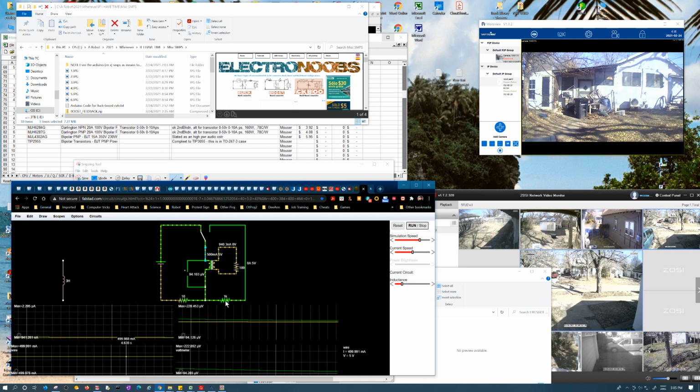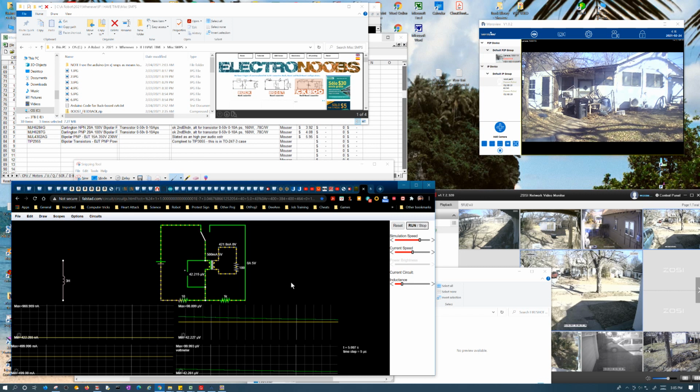But again, it may not be doing that. It may just be that it behaves differently at first, so it just started out as if this were hooked to that battery, but then after that, it just acts like an inductor, and it's charged. The fact it's got a load modifies the shape of the charge curve. That actually could be demonstrated, because that's what I'm going to do next: put a diode here, like a switching power supply might have, and see how that works.